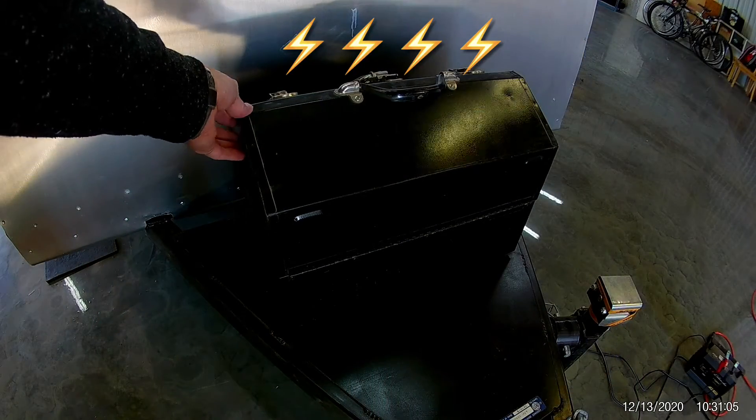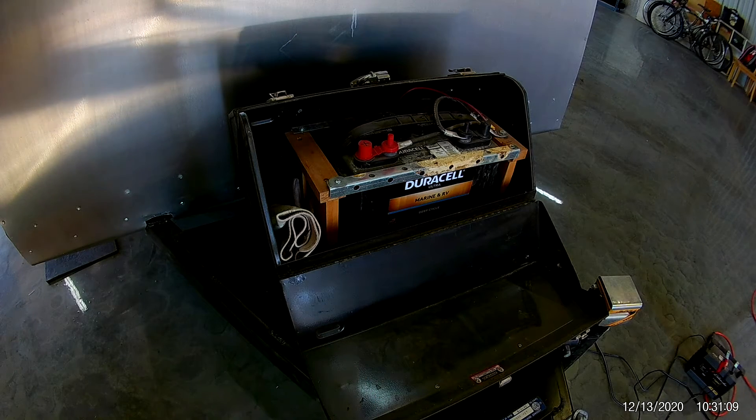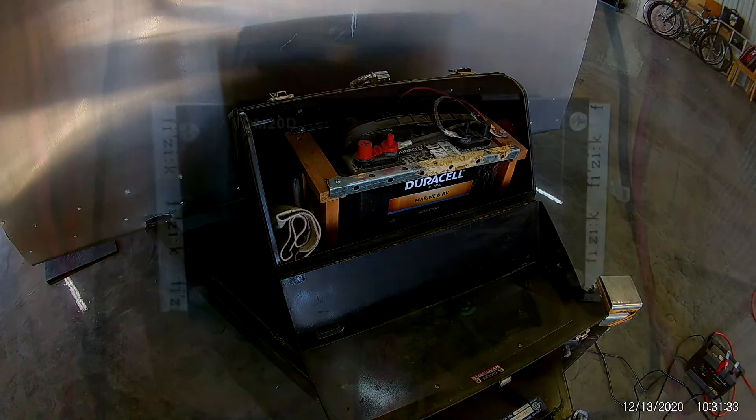My favorite component is the battery. Battery technology has probably advanced since I built this in 2016, but this is a tried-and-true 75 amp-hour marine battery and it suits my power needs for running lights, stereo, and USB charging just fine. I don't know how long it would work with an inverter for AC power, but it would be fine for filling air mattresses — though a microwave oven might be a little too much.